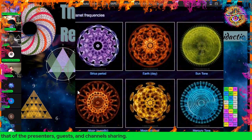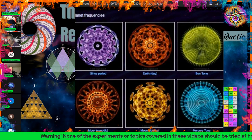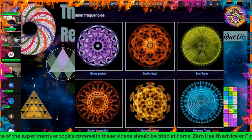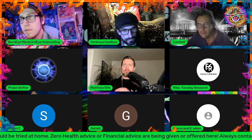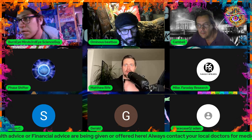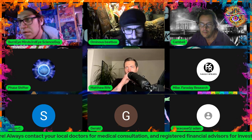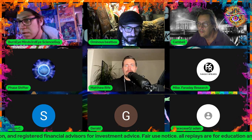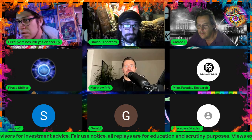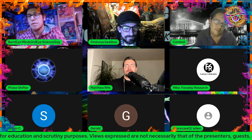In my case, I've done some experiments with different style coils, all involving the same exact copper mass. Since I chose to use the same length of wire from the same spool, it gives me a fairly stable, consistent comparison for copper mass. I've taken some single filar, bifilar, and quadrifilar pancakes and stacked those in layers to see what my transfer efficiency is. Technically, they contain the same amount of copper, and if you map them out, the turns end up being the same, but the angle of the turns has a discrepancy, so you get interesting transfer characteristics of the magnetic and electric flux.